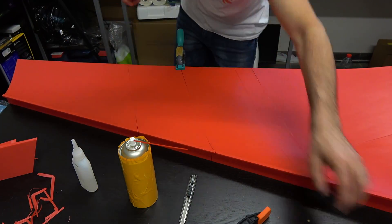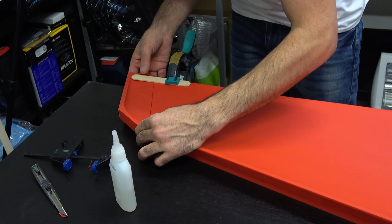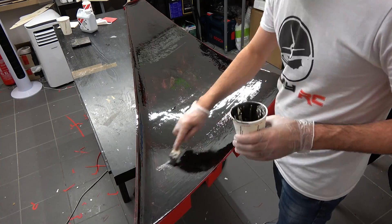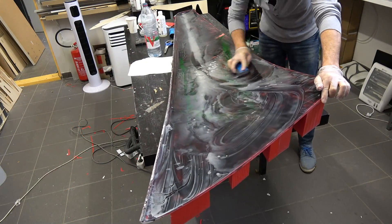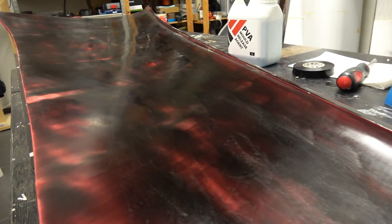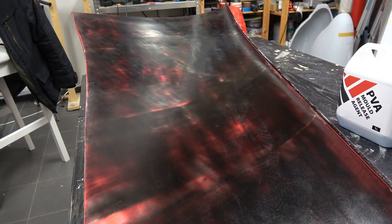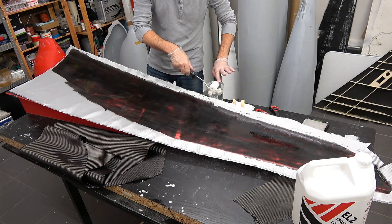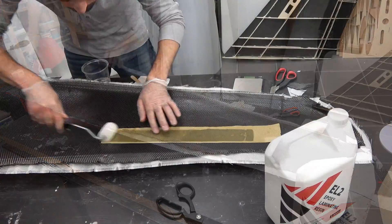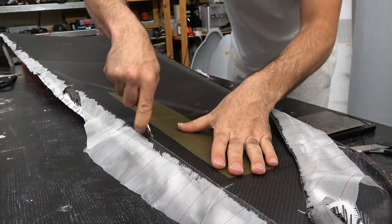So this is the top side of the left wing. I decided to cast it because the print was done, and because I like to try new things, I thought I'd cover the whole mold with epoxy. I've done the same thing on smaller molds before, like engine nacelles, and the results were amazing. But because this is so big, I spent about three hours just sanding and wasn't even finished. So I just decided to cast it anyway.